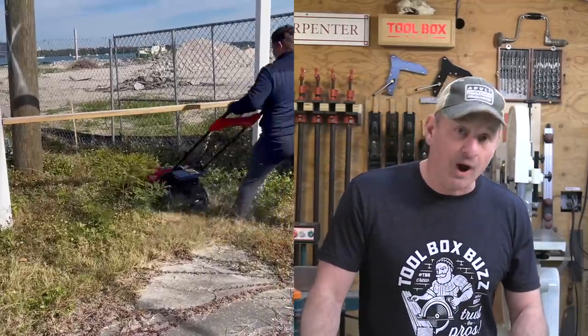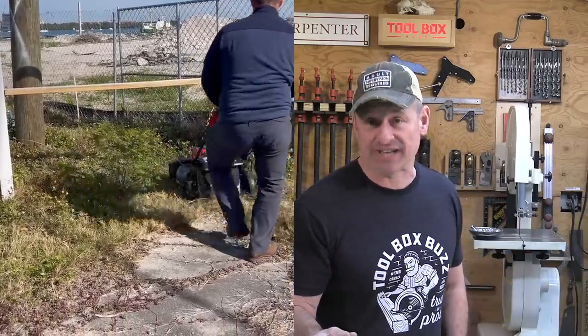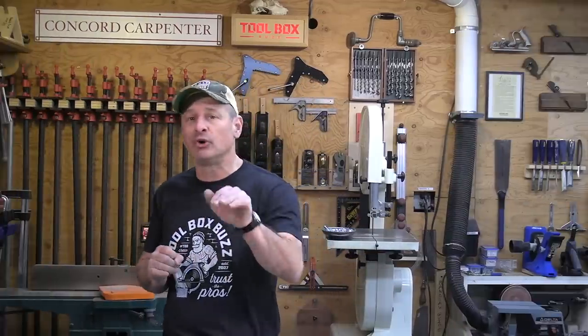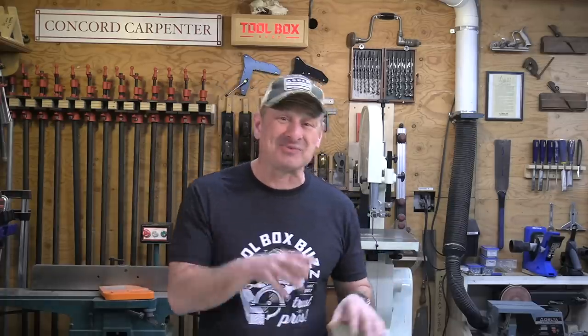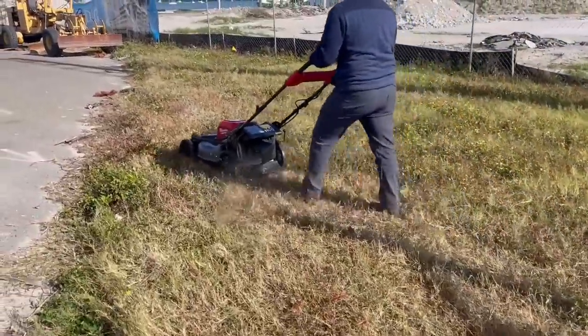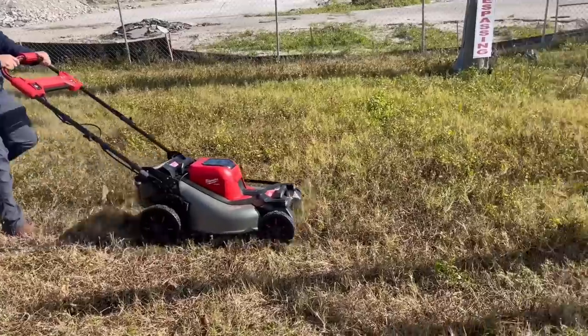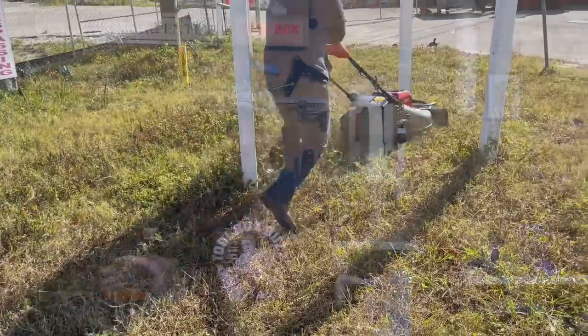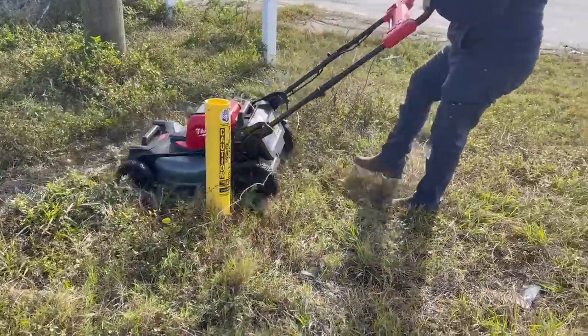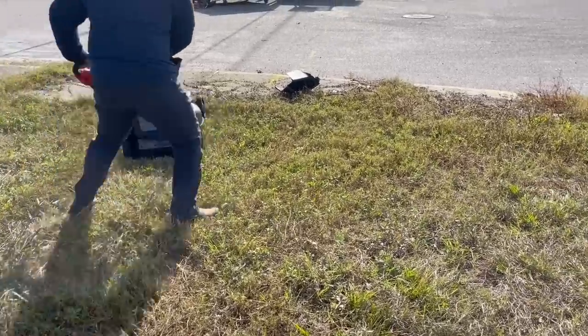For the first cut test, we started with the mower deck set at six and a half inches high to cut the weeds down and check for debris or rocks. We then used a mulching plug to see if the mower would choke on the material — it cut through with no trouble at all at relatively high speed. We didn't evaluate mulching capacity at this point since the material was too thick. Our typical speed on the first cut was between 3.5 and 4 miles per hour, the cut lasted a half hour, and we used one LED unit of battery.